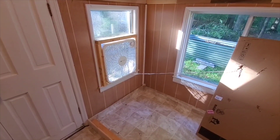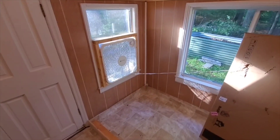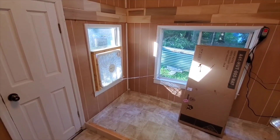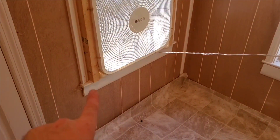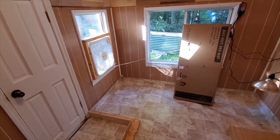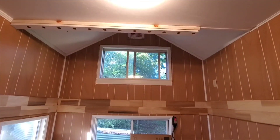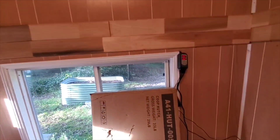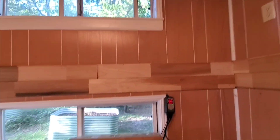There's a fan permanently installed in the window, installed under an overhang on the side away from the prevailing winds. That should allow for airflow as needed during the summer. In the winter, we'll put a piece of plywood in front of that fan, which we can fasten with the frame around the fan. It's been filled in with expanding foam to keep critters, snakes, and things out, and there's also a screen behind that. This window is cracked open so when the fan turns on, it moves cool air in from the bottom and pushes hotter air out the top.